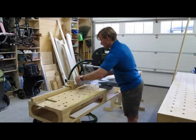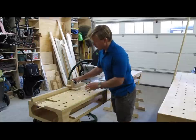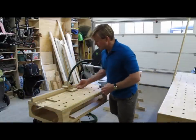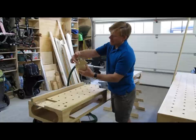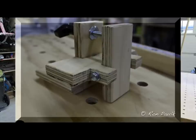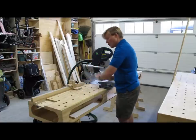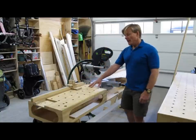Or if you just want to remove it altogether — if this fence were lined up, you wouldn't be able to do that. When I install this and set it on the dimension I'm looking for and crank it down, when I slide material into it, there's no deflection or movement. This stop has a wide 2-inch clamping surface and the back clamping board is bolted through and has a bit of pivot to it. When pressure is applied with a carriage bolt installed backwards through a T-nut and a large plastic T-handle, I get a nice amount of pressure.